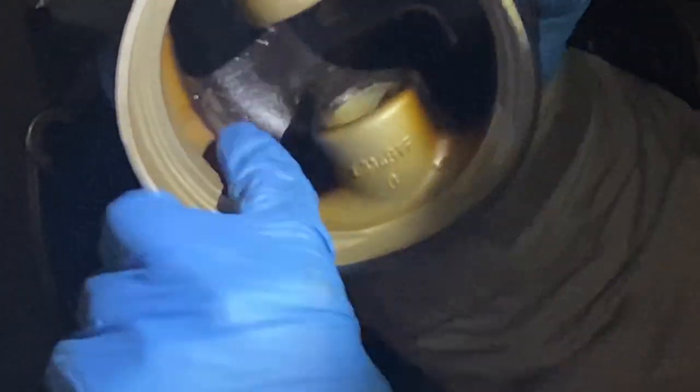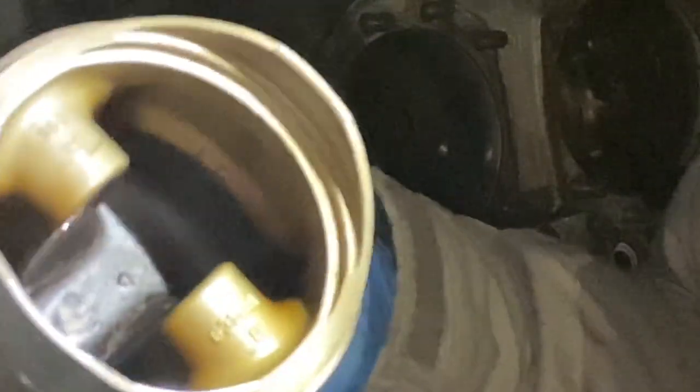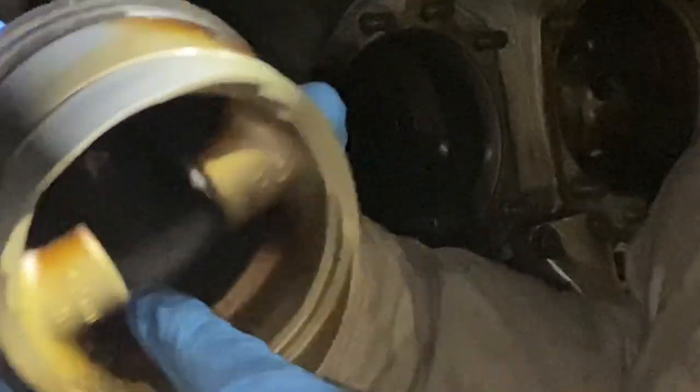So, again, top of the piston really carboned up down in here from the heat of the blast in the fire chamber. The ring's trying to hold it off, and heat is obviously getting past, going in here into this oil ring, and then the heat is injecting in here and burning the oil, because the oil is being pushed in here to help lubricate this. In turn, it's cooked it. And when you get done cooking it and you get these holes plugged up, because it's all baked and plugged, it's corroded, or carboned up, then you lose oil in your oil ring and your oil to lubricate.